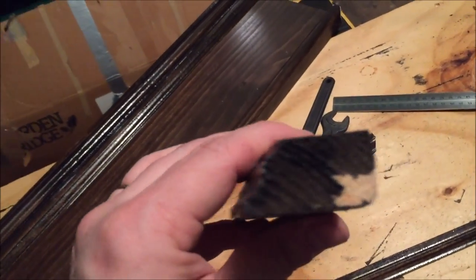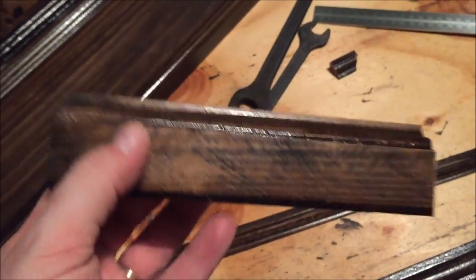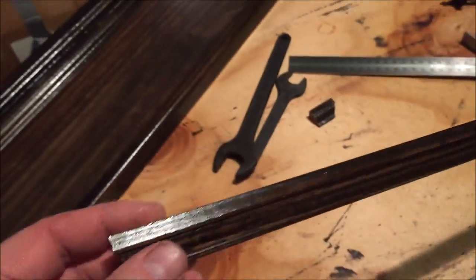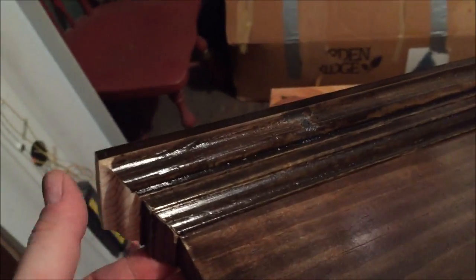This piece right here that I routed out with a Roman, whatever it's called. That's what that is, and that's at the top. And then that flat 1x6 sits right there. And then I've got a thin piece of trim right here that fits in between. It fits right in that little area right here. And you can see I did 45-degree angles and got them all meshed in there. I'll have to restain the edges, of course, where I routed them over. But I'm really, really proud of how it came out.